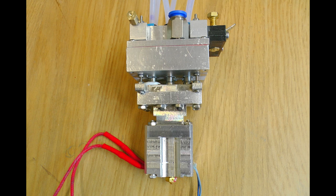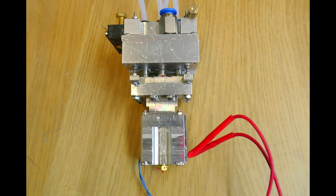I've investigated the various other faults. The thermistor fault was indeed the thermistor itself — I hung another thermistor on the end of the wire and it's fine, I can waggle it around and it's fine. So I need to change the thermistor. Two extruder motor faults: one is definitely a dead motor, which is odd — that's about the third extruder motor failure I've had since using Duet 3. I don't know if there's anything significant there or if it's just a tough patch of extruder motors.